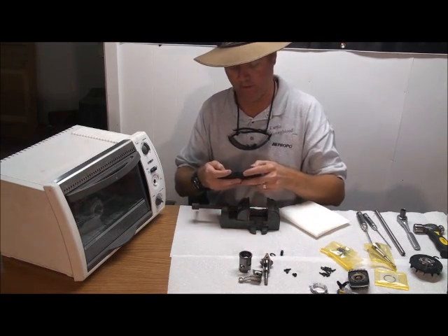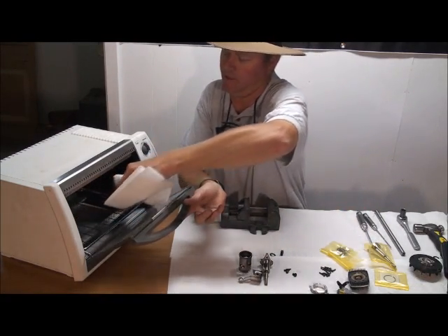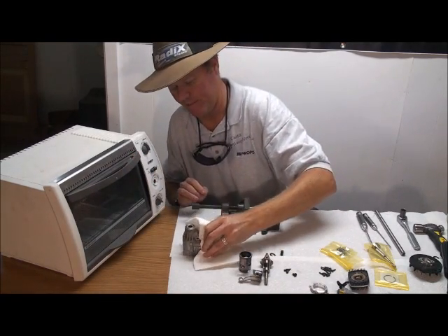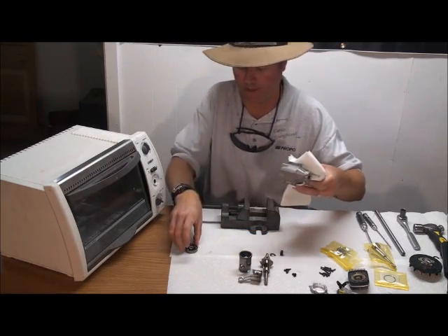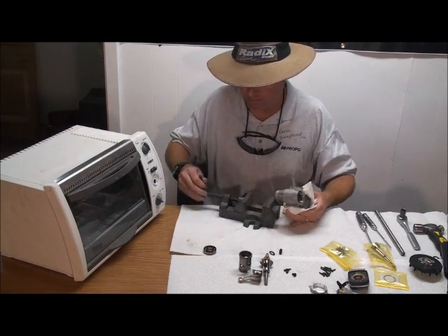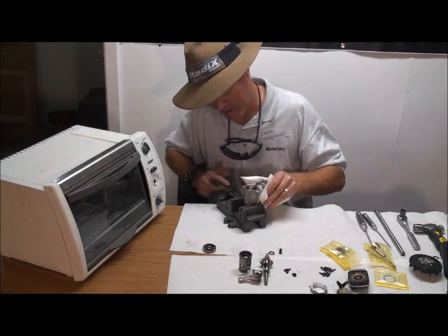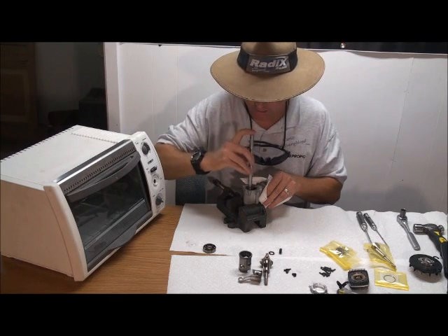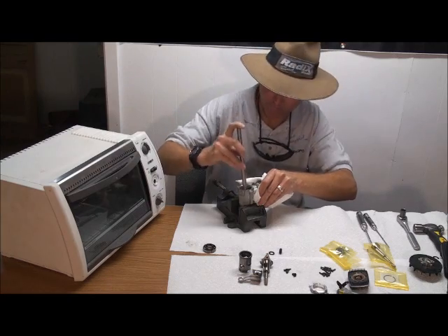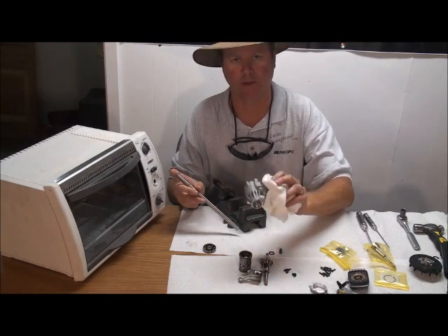I think that's our 20 minutes. Let's get our motor out — it should be good and hot. I just use paper towels; you could use an oven mitt or something. The bottom bearing — the back bearing — you should just tap and it comes out. For the front bearing, I'll use the vise to give it a good base to sit on, then tap it out with the main shaft. Got the bearings out. Now I just need to clean the motor out with some paper towel and alcohol and be ready to put the new bearings in.